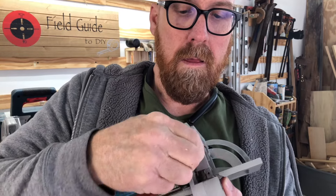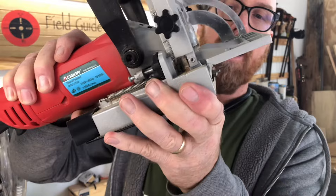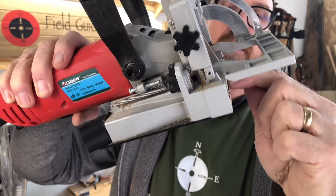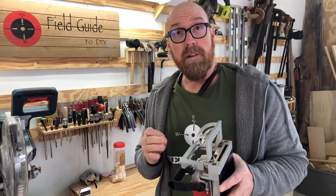This will raise up and we'll tighten it there, and this way when the blade comes out it'll cut that offset from the tabletop or desktop. If both grooves are the same depth, then when the biscuit goes in that slot and the two boards are butted together, the tabletop or desktop will be level or even at that seam.